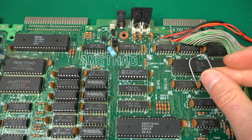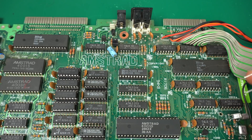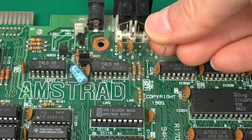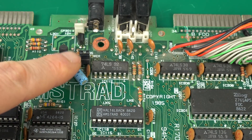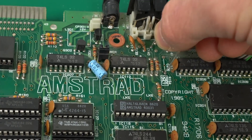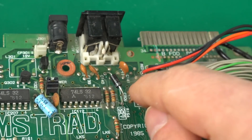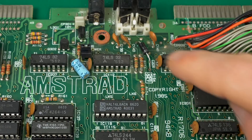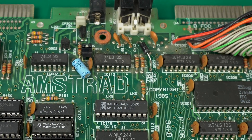So where exactly are we going to put the diode? We need to find somewhere between 5 volts and ground, and hopefully a place that has eyelets or vias. Looking with a multimeter, a good place seems to be 5 volts here and ground there — it would fit right like that. I also want to make sure it's positioned after the switch, so it only kicks in once you actually turn on the Amstrad. I'm going to leave it hovering, not touching the board, because it's going to get hot if that ever happens. That should prevent this disaster from happening again. The Amstrad is fully repaired — I checked it over and all the other chips were fine, so really it was only the RAM ICs that blew up from the over-voltage, and that shouldn't happen anymore because we have that protection diode in place.